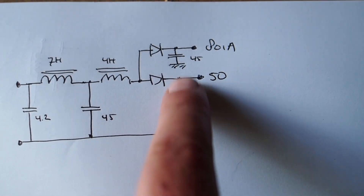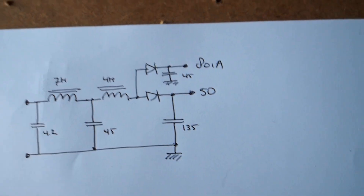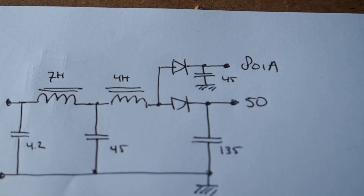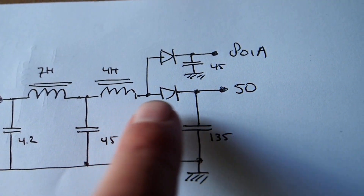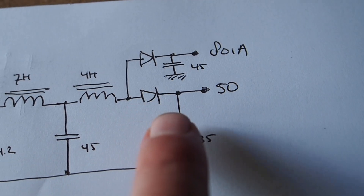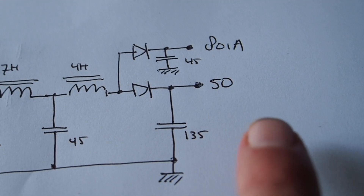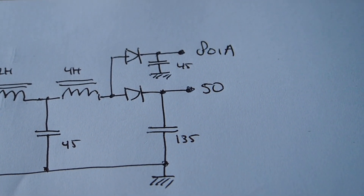The power draw here will be at a time when this is not drawing power, so these are not really fighting for the same current. As a result, the voltage changes here would be less than if these were in phase and were actually both charging at the same time, because you would have some kind of competition. But with the current construction, with these tubes in counter phase, you get quite optimal charging.